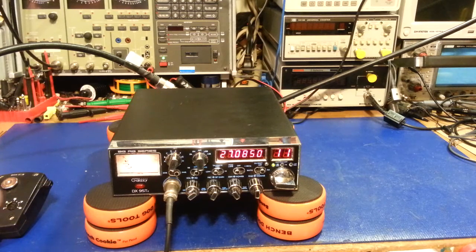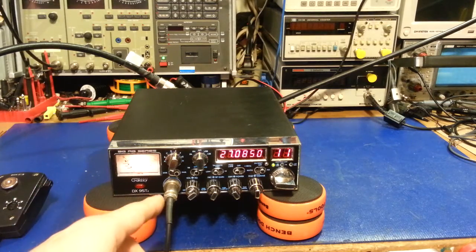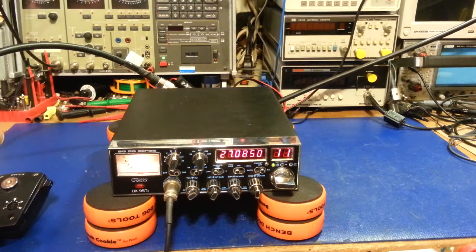When you align the transmit circuit, in the beginning stages you're peaking all the transformers. Once done in AM, you're supposed to switch to sideband mode and readjust certain portions for least distortion on sideband. There's also an adjustment for the APC voltage — supposed to be set at 8.5 volts, but it was set at 13.2. Once both were adjusted properly, the ALC circuit was close to correct. The AMC circuit is now properly adjusted and the modulation limiter is still in the radio.